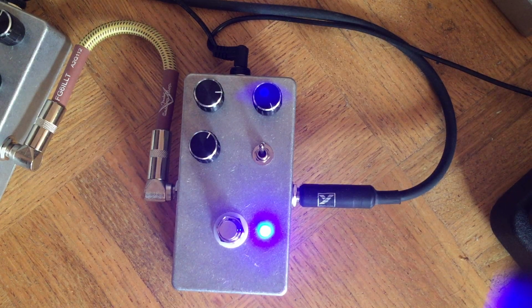Now, hopefully this is coming through, but the EQ on this is much flatter than it would be with a tube screamer, except rather than have a spike in the mid-range or upper mids, this has a very high spike in the treble frequencies, which is why the tone control on this is so important. It does roll off the bass a little bit, probably around the same levels as a tube screamer, even though the curve of the EQ is different between the two pedals. So it might not necessarily be the pedal you want for all those doomy, hardcore, heavy tones. I don't know how to describe them. But then again, you may still want it because it does have the bass roll off. It could easily be used as a boost when you have the boost mode in to keep things nice and tight and everything.